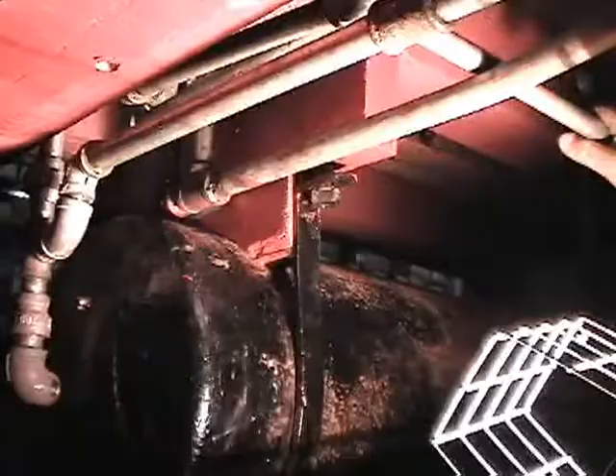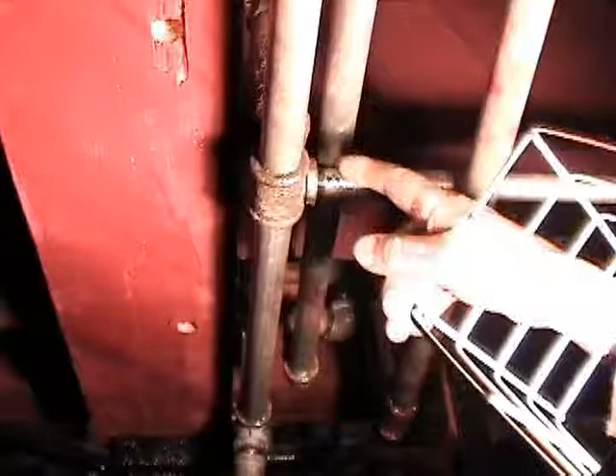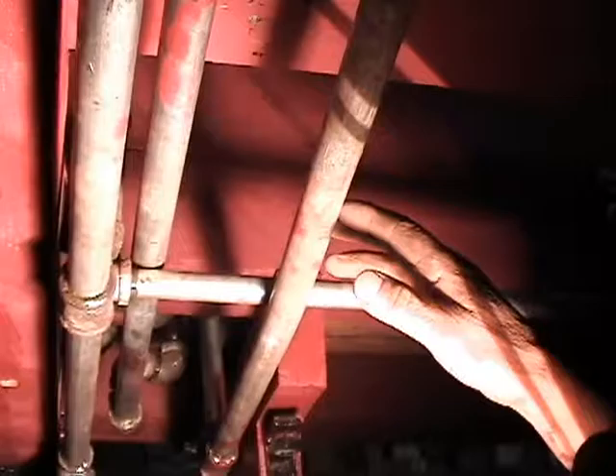This little device is a safety valve — it will blow off if the air compressor doesn't stop and air continues to flow into the system. Normally they're not located in such a hard-to-get-at place, but this is where it was originally. All these pipes have certain connections — everything starts here and goes back to the other end. One pipe feeds the sander and whistle on the other end, and there's a pipe that goes the entire length of the locomotive and then to other cars in the train.